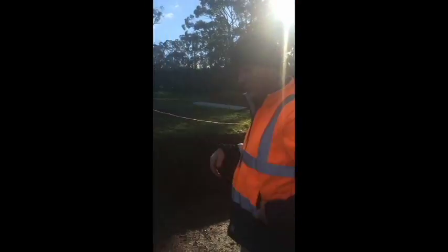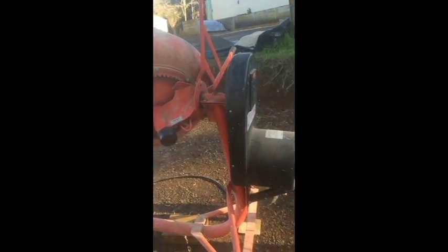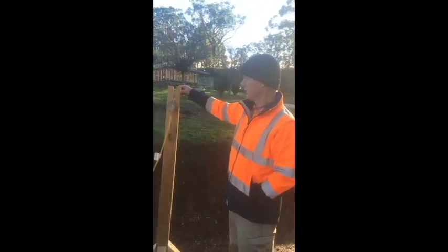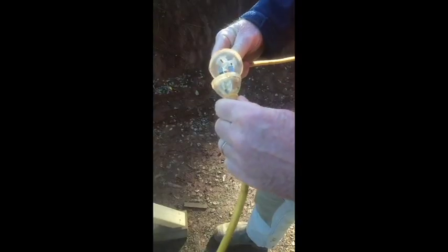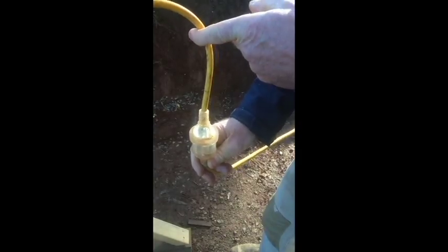The other thing is safety. You're going to be using a hose with the cement mixer, and hose and electricity don't mix, so it's really important to have a lead stand. This plug has a little lip on it — if it's hanging the wrong way it will fill up with water as you spray around, so you want it hanging so the water runs off past the plug.